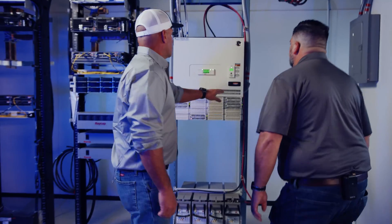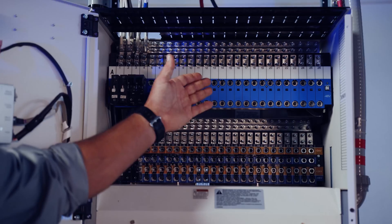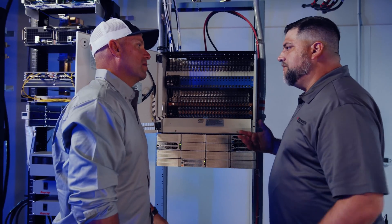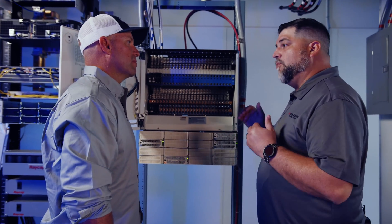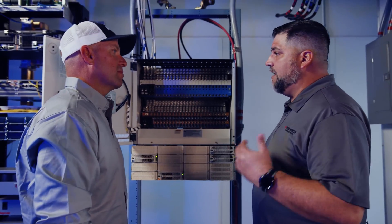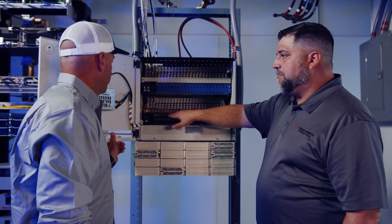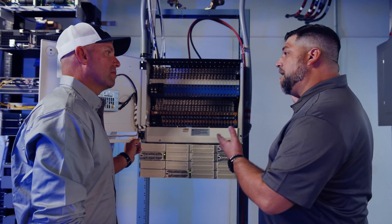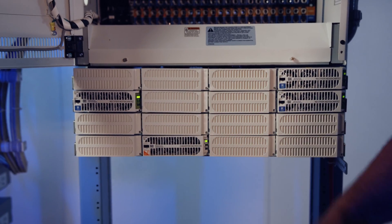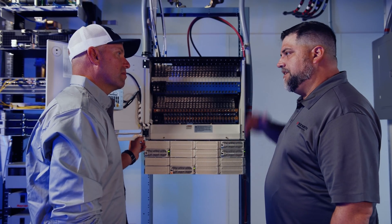We talked about NEG48. Let's check out this panel over here. So in this power plant, you've got two rows — a NEG48 and a positive 24 — two different types of voltages in this piece of equipment. Most of the time you're going to have one system that's either NEG48 or positive 24, but in this case there's both. You have breakers on the positive 24 and breakers on the NEG48, depending on what type of equipment you're operating. In this case, you have rectifiers and batteries here that supply the power to the DC power plant.